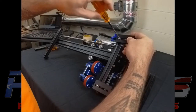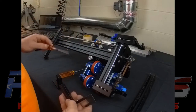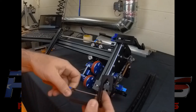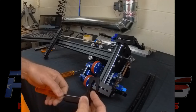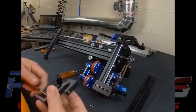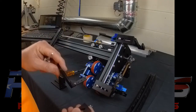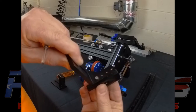Since these kits are usable on different types of rotaries, when you get them they're all going to come the same. When you put the two on this end, you're going to want to take this apart. These are adjustable — for the Junior, they're going to come on the two lowest spots. For the Rotoboss, you want to put them up on the two higher spots, so they'll come down like that.